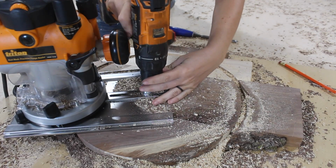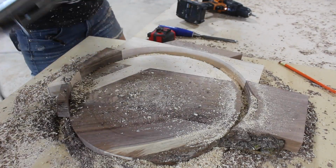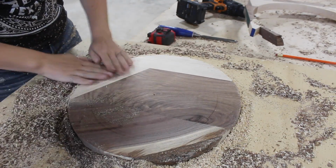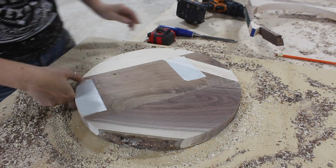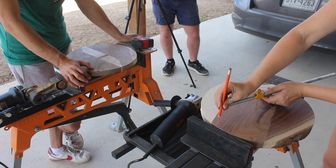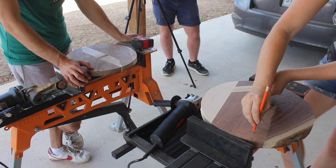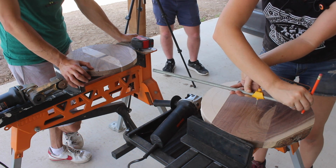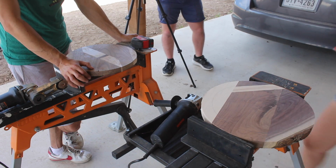One tip to remember if you do this project is to attach your seat upside down so that what will end up being the top of the seat is facing the workbench. This will make the screw hole from attaching the router in the bottom where it will be unseen instead of on the top. Alrighty, with that done, next we moved the seats to the super jaws outside because the next step was to start dishing out the seat some. Just to give a visual reference to follow, we used a compass to pencil on an offset line and then started sanding away material.